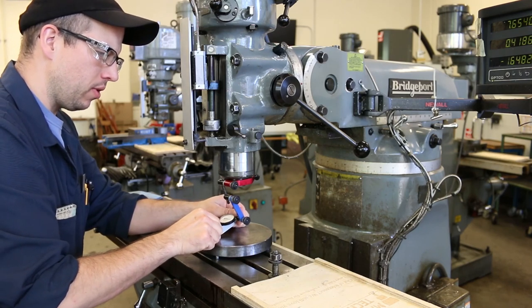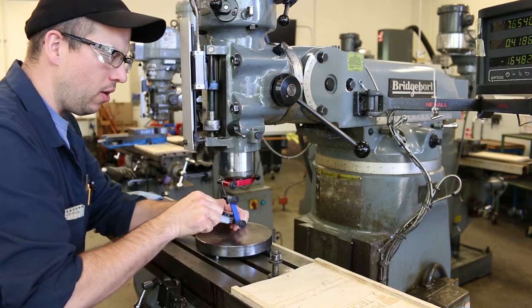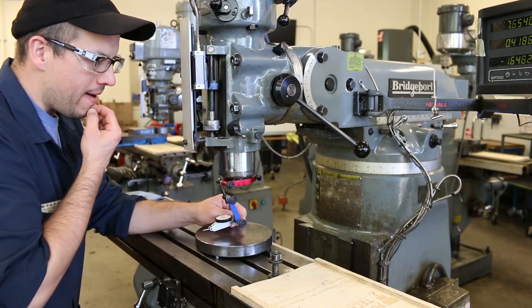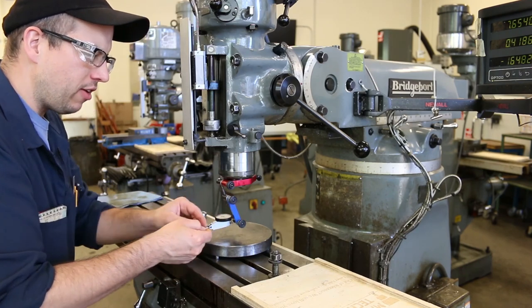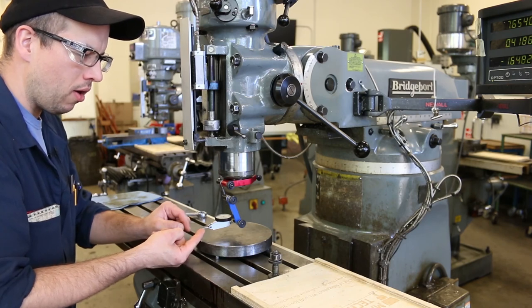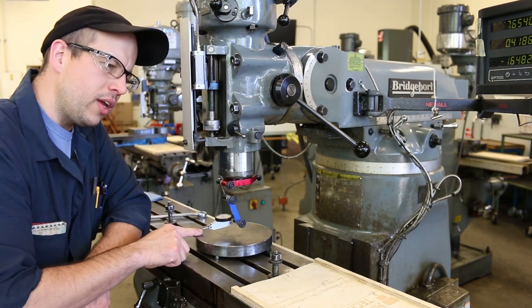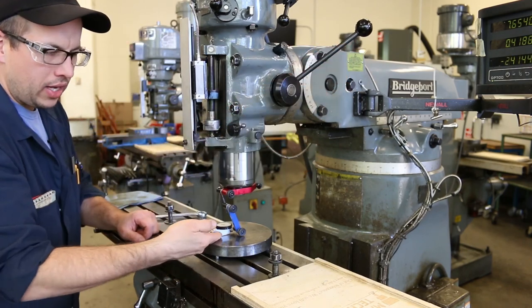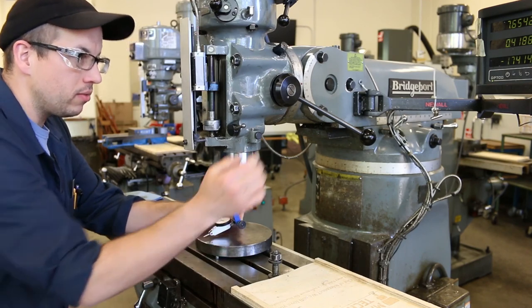Now, I really need to make sure that the indicator pointer arm has the correct angle relative to the tramming plate. Now, the angle of the indicator itself is kind of irrelevant because the pointer arm can be adjusted to whatever angle you need. But you need to make sure that the pointer arm itself has a particular angle relative to the tramming plate. Because of the way that this works, it's actually measuring a rotative motion here, right? It's not measuring a linear displacement. It's measuring the rotation of this little arm. So really, this thing would like to be perfectly horizontal to the surface that you're measuring. But we can't usually get away with that, because if I put this exactly horizontal, then I would probably bottom out on the indicator body before I actually contacted the indicator tip, or the pointer arm. So I need to adjust it at some angle, right? Some minimal angle.